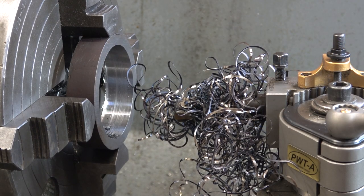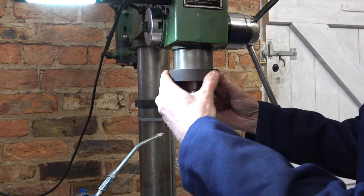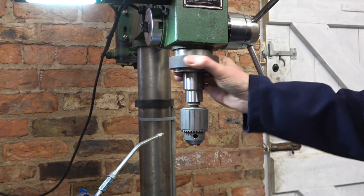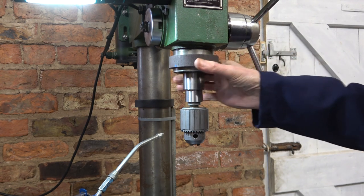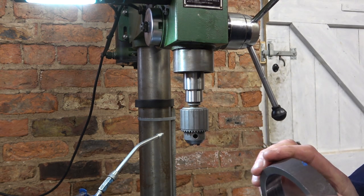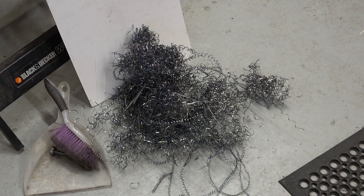Hacks Be Shed meets EN16T. I think next time I'll buy the free-cutting grade — I only got this because it was a couple of quid cheaper. That's to size. I'll try it on the drill quill, and assuming it fits the next step is to face the outer and the two ends. That's pretty good. The ring is slightly warm — I hope it's going to fit when it's cold, but I think it'll be fine. I'm pleased with that actually. That's three quid of ring and five quid of steel — you can make me an offer if you want.